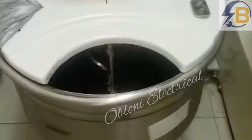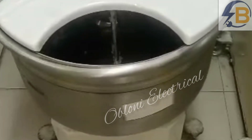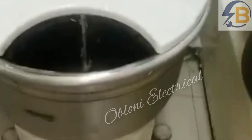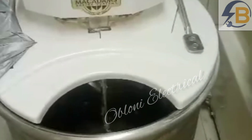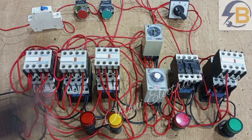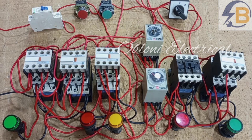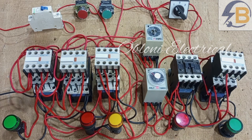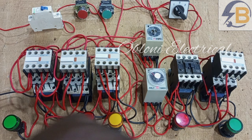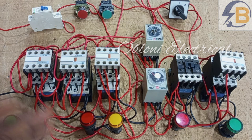A two-speed motor has its own format of wiring — later I'll be doing a circuit diagram of how the power circuit of a two-speed motor looks like. So this control is for that two-speed motor that turns the mixer, and then there are also two contactors that will help you to either make the bowl go clockwise or anti-clockwise. All these are built in the same circuit and work simultaneously.